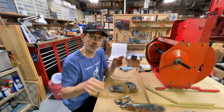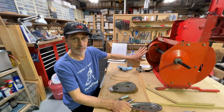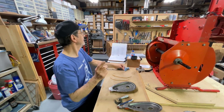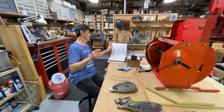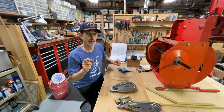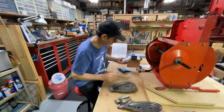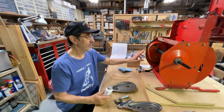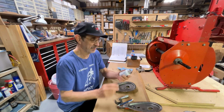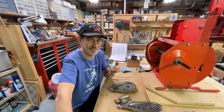They have the better cork gasket and have the extra holes in the chain case and the bottom of the differential. They'll have extra bolts in here. And the owner wanted me to use a particular Permatex gasket sealer. I've already installed it on here because I wanted to see what it was like to use before I tried something new like this on camera.